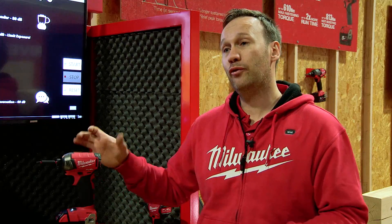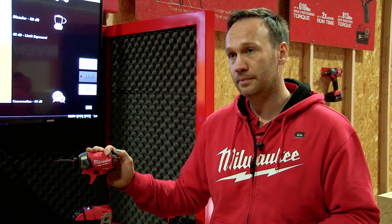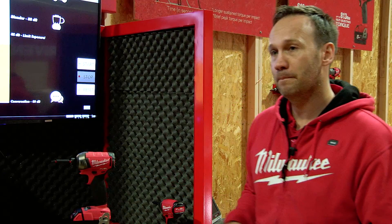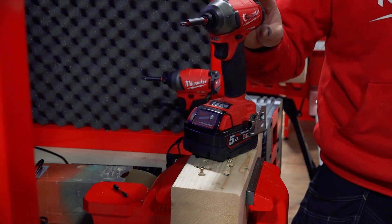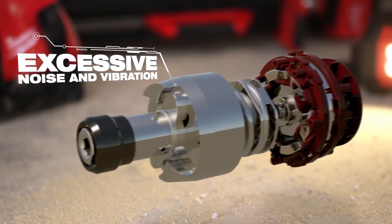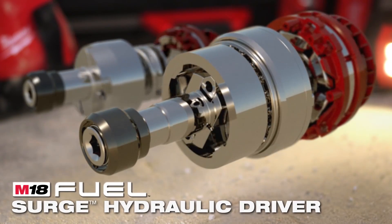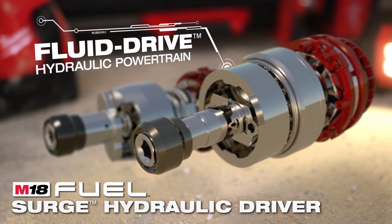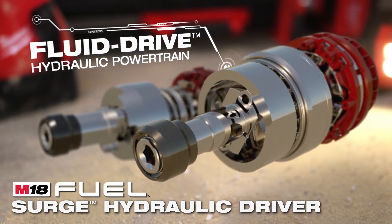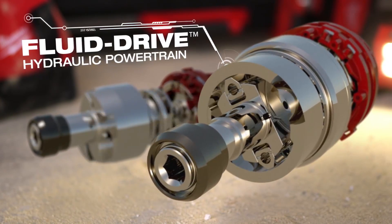You don't have a back force like a drill driver when you use an impact driver in general. So that's what surge technology is called — correct. And what's going on inside? Inside you have a liquid, which means you have less friction between the metal. On a normal impact driver you have metal on metal contact, and that's how you make the force. Here you have oil, which means you reduce not only the sound level but also have a huge advantage on durability because you have less material pushing against each other.